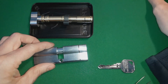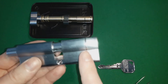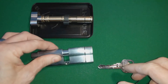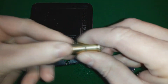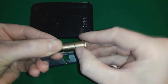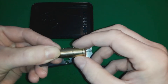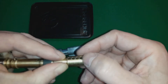This is the cam lock — this is the end that goes on the outside, and this is the bit with the cam. Here's the anti-snap feature, and that corresponds with the core. Here's the anti-snap feature on the core. It falls in line with this pin, so there's very little amount of this brass, so it would surrender itself and snap there and still leave three of the pins intact.